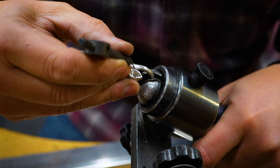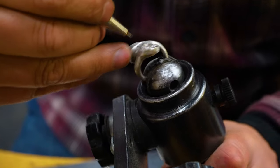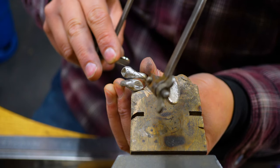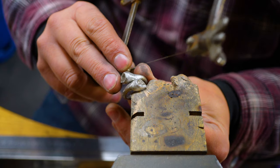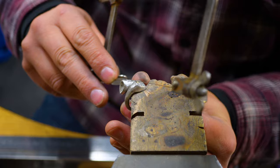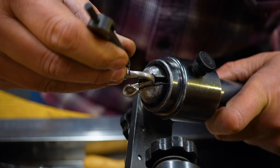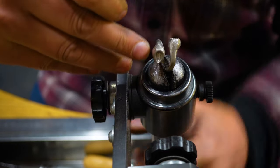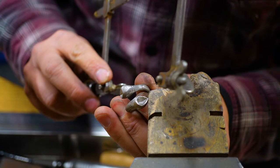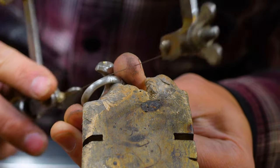I marked a line, a little parallel line. I made these about 1.4 millimeters wide every time because the stones going in there were one-pointers — 1.25 to 1.3 millimeters. But I also gave it a little bit of space because there's a bit of cut work to get the set work done.